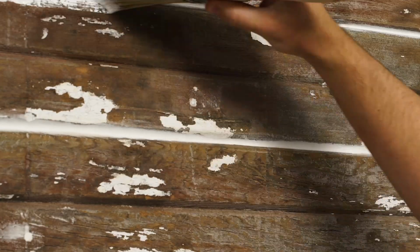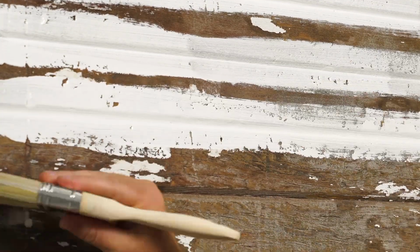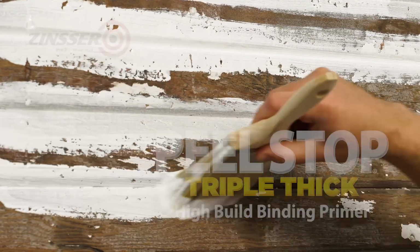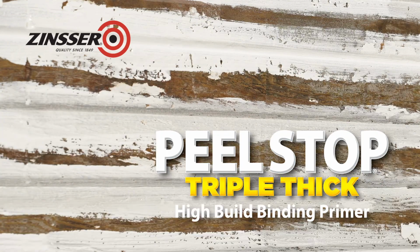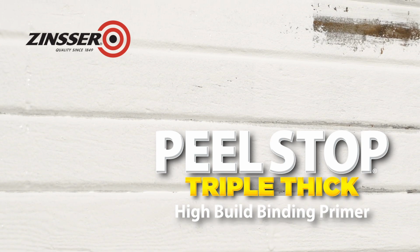Plan and prep. First, prime your surface. Primer helps seal the wood and increase the surface's durability. We recommend Zinsser Peel Stop Triple Thick, 3 times thicker and twice as flexible as ordinary primer.